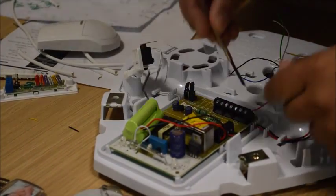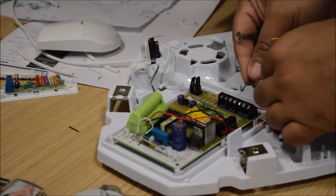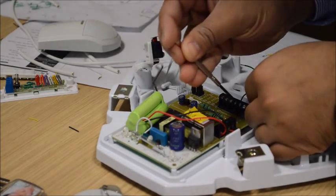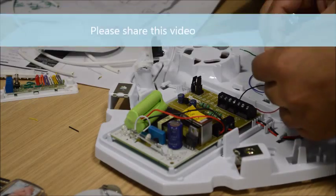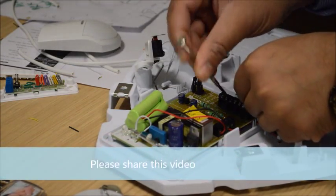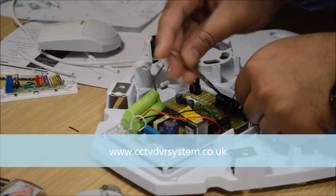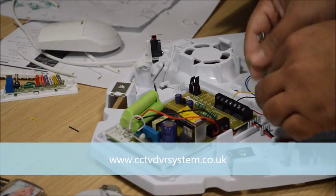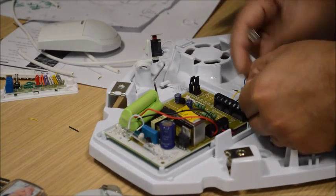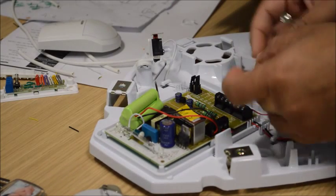To start with, the first thing I'll do is connect the power. That's not going to be very difficult, just to get the 12 volt and the ground. I'm using black and red. I'm going to use the yellow one for strobe first, and then I'm using green for tamper. And the last thing to go is the bell — I'm using the white color.